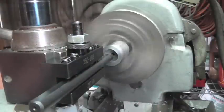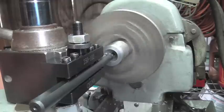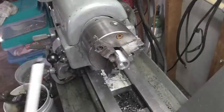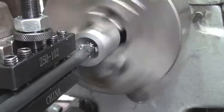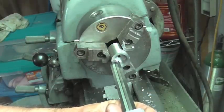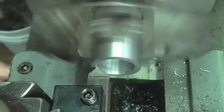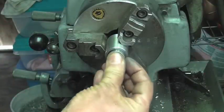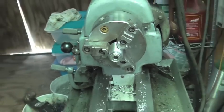The big drill left a cone in the bottom of the bore, so I'm using the Banggood boring bar again to peck that out and get a flat bottom so the bearings will sit flush. What I'm shooting for with this bore is 560 thousandths deep and 22 millimeters exactly in diameter. Due to my lack of experience I'm not sure whether to go for a press fit on these bearings or just make the bore the size of the bearing and use some Loctite, so we'll see.